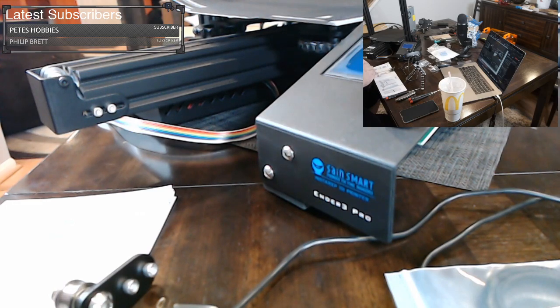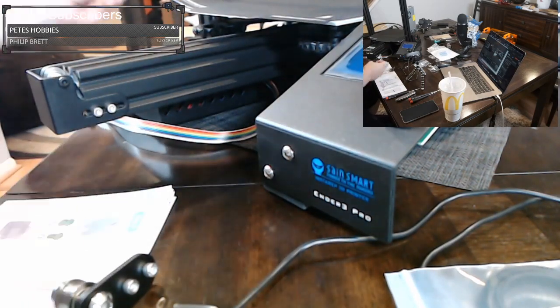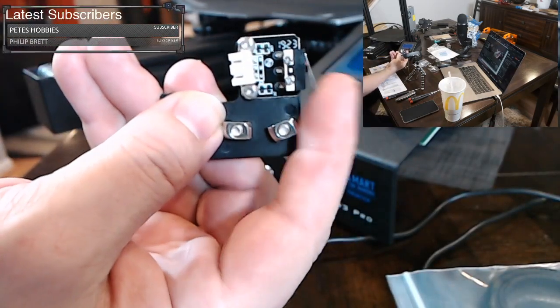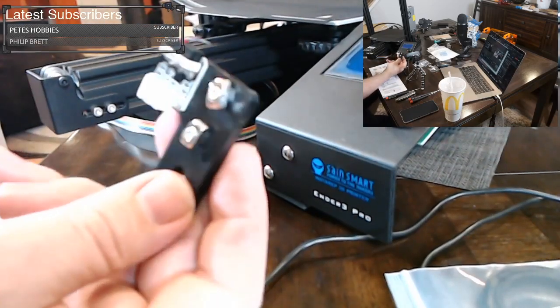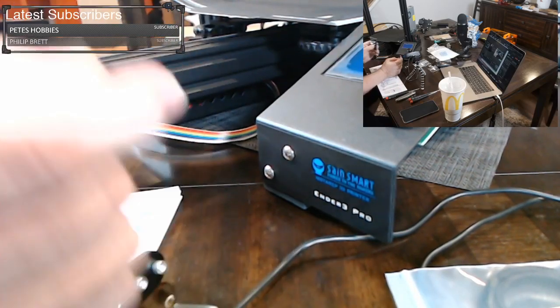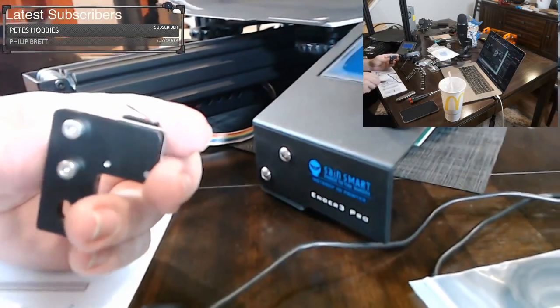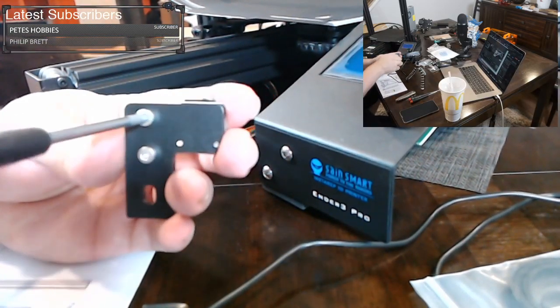So here's our Z end stop. It is only a switch, it's a little clicker. That's pretty much it, but it has on it already these two nuts. And these are the nuts that are going to go into the extrusion, but we need to make sure they rotate the right way when we do it. The screw size we're going to need, let's see which screw size this is. It's the 3 millimeter.